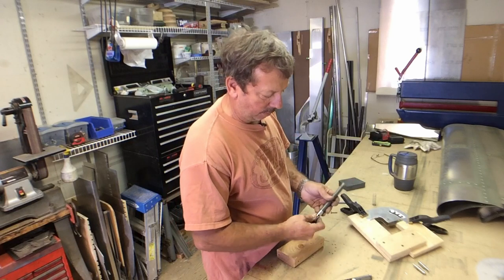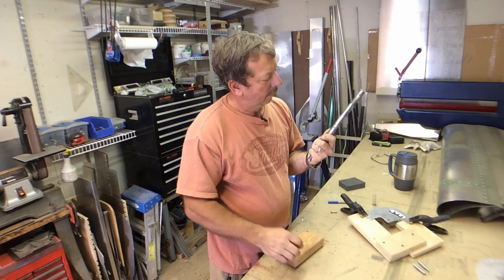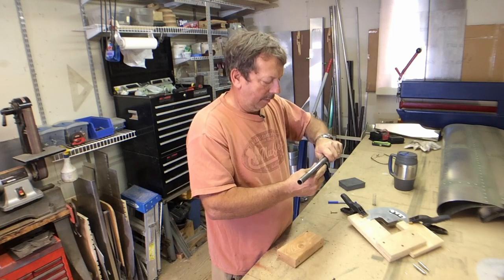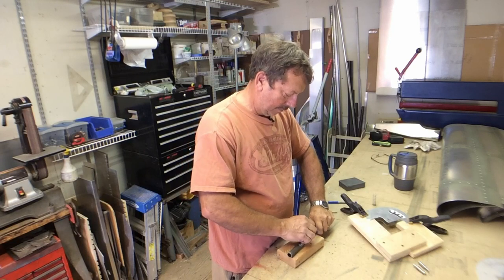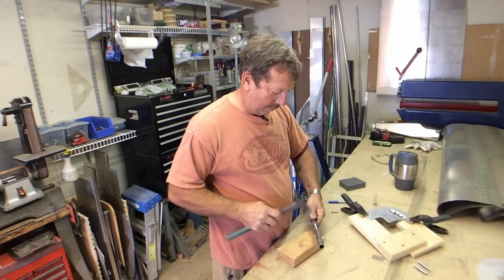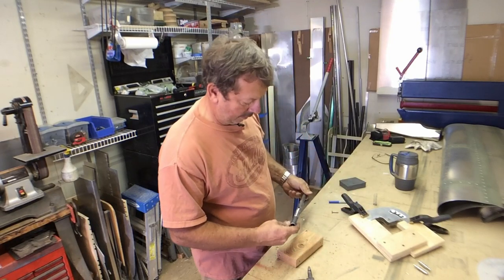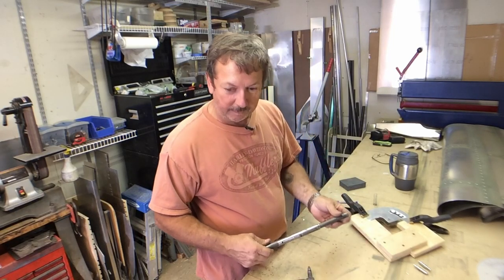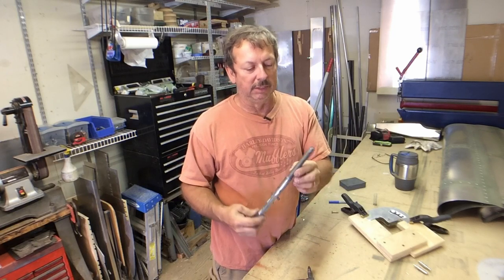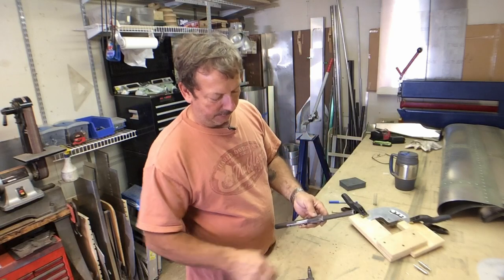We've drilled that, takes a 1/4-inch roll pin, we slide in and out, and we compress it to right there. This will get shortened up and just a cap put on. I'll probably turn a billet cap to the contours nicely in there, but just a standard button cap of some sort will be on top, protruding just enough to where you can push it down. And then that'll be shortened up, of course.